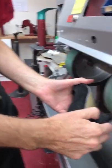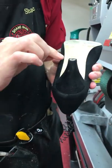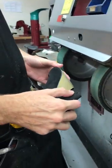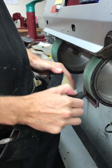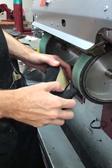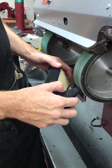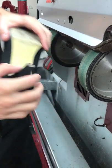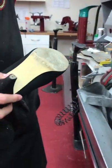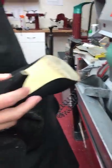If you just grind across there once at a slow speed you're going to end up rounded, because it takes the plastic away much quicker than the steel pin. So what you want to do is move it forcibly square past it. If you're going past it generally, you want to go quickly over the plastic, a little bit slower in the middle, and quickly over the other side of the plastic — so like fast, slow, fast. I'm going to go from the back, the side, the side, and the front, and then we'll see what it looks like.